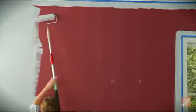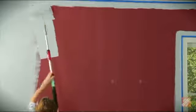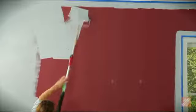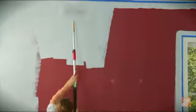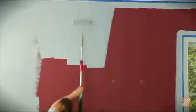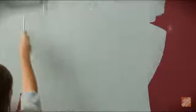When applying your primer, start by painting in 3-foot by 3-foot sections. Roll in one section at a time, moving from top to bottom and from one side of the wall to the other. With a fully loaded roller, work top to bottom, rolling back and forth across the wall in a series of V or W-shaped strokes until the section is covered. Reload your roller and paint the next section, covering only as much as you can finish while the primer is still wet. Always overlap areas of wet primer. This is a painting technique the pros call working to a wet edge. The technique helps prevent streaking.